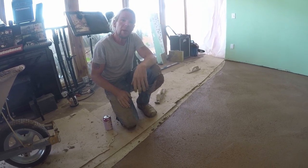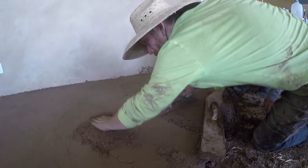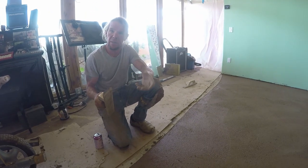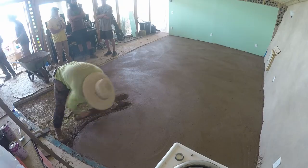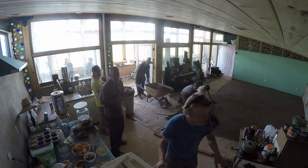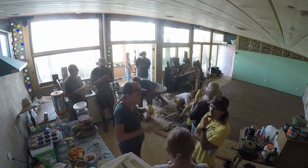Whereas a hardwood trowel — these are oak, just cut out with an old trowel, this was just a piece of oak flooring — leaves the proper consistency. The ones I made last year are a little narrow, they work but the new ones have a nice broad blade, making it a lot easier to get the proper finish. Tomorrow we want to come back and start working with steel when we can't separate the mud into its constituent clay and aggregate anymore. At that point we're just pressing and gently moving a little bit of mud. That's when we transition over to steel — this wood stage just makes sure the surface stays the same consistency as the whole rest of the floor.